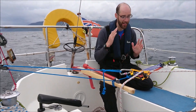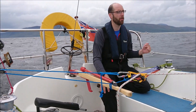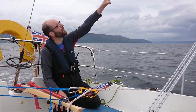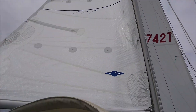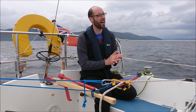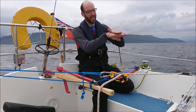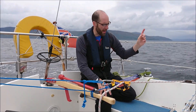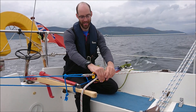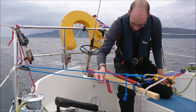The principle of sailing downwind with a self-steering system is more or less the same as sailing upwind. What you want to do is instil some negative feedback into the boat. What we have here is the mainsail, and then behind the mainsail we've got the jib. When you're on a broad reach or a run, the jib is sheltered behind the mainsail. The idea is that as the boat comes up into the wind naturally, the jib gets exposed to more wind. The jib then pulls harder on the jib sheet. This jib sheet is then rigged through an ascender, which allows us some adjustment — that's Cam's idea — through this snatch block, back to the tiller.